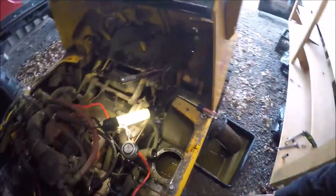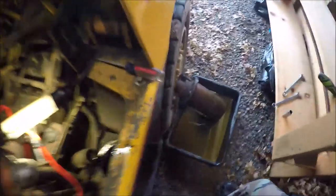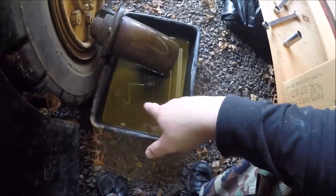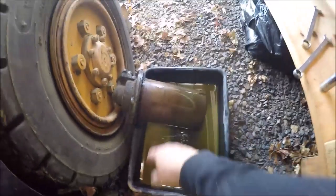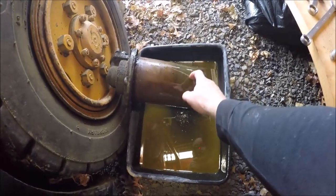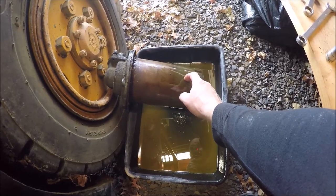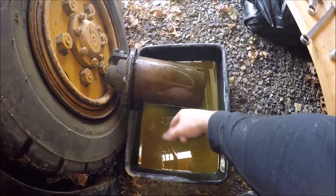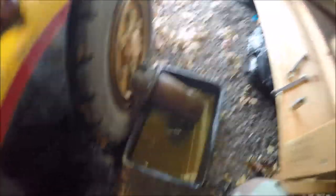While the cylinder's out and getting rebuilt, I figured I'd go ahead and get all the old hydraulic fluid out, get a new filter in, and put some fresh stuff in. Here's the filter. Looking at the manual, apparently it's like a two-piece unit — it's got a metal screen that you clean, and inside there's apparently a paper filter that you replace. Hopefully that filter on the inside has got a part number on it — that would help me out greatly.